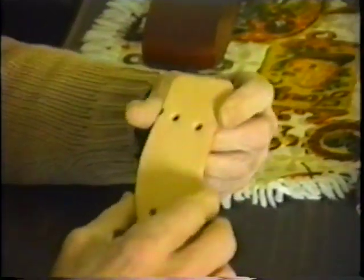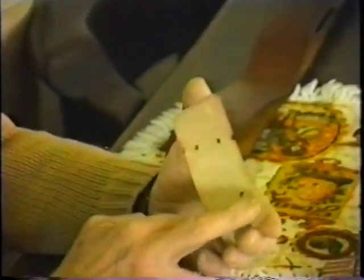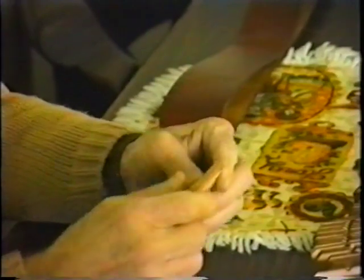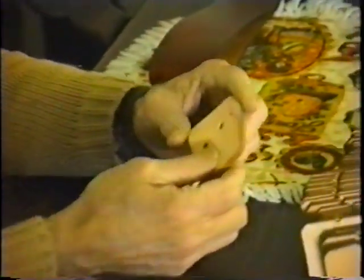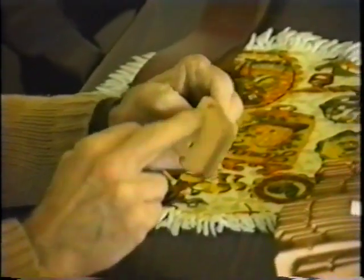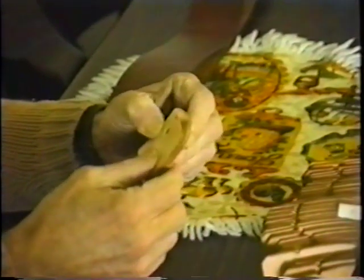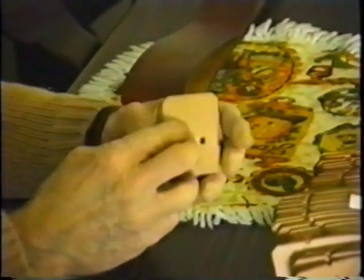The ear has to be blanked out — you have to buy a whole hide. I have a die at the leather maker's and they stamp these out to this shape. When we get them here, we put contact cement on the inside so that when it's folded it'll be rigid, so as not to get the ear dog-eared when you push on it. It's wrapped and laced with calf skin — we usually use old heads or scrap calf skin. You soak them to make them pliable, then lace them through the holes and tie them, and you end up with an ear like so.